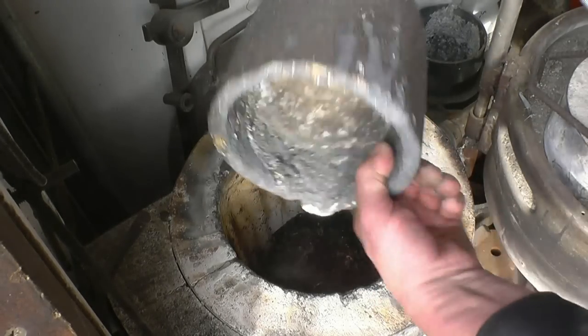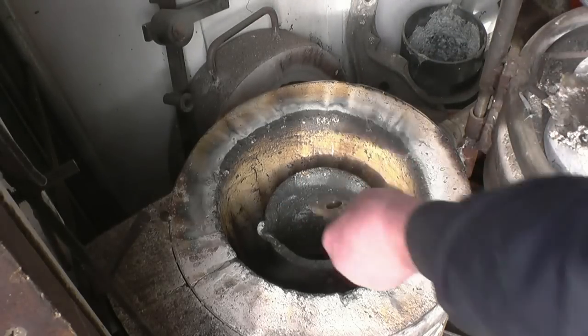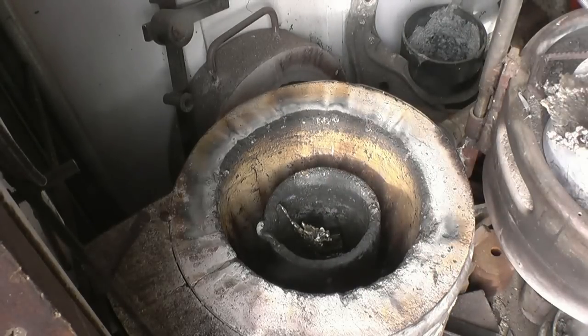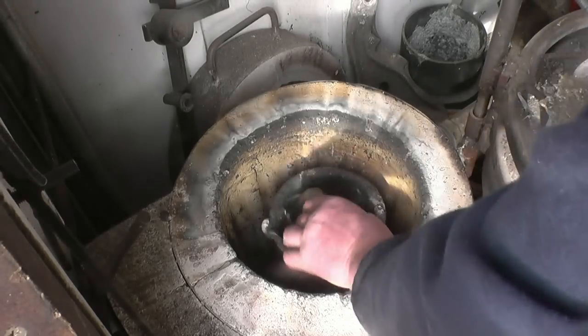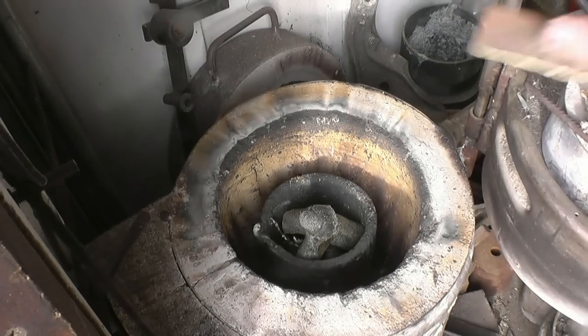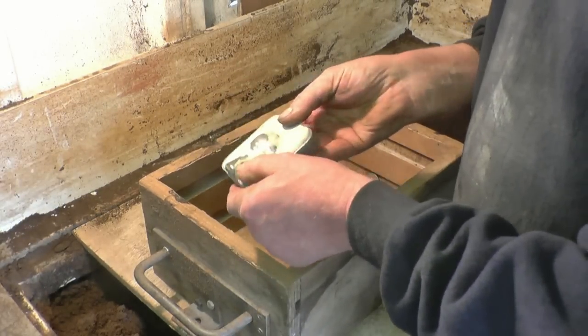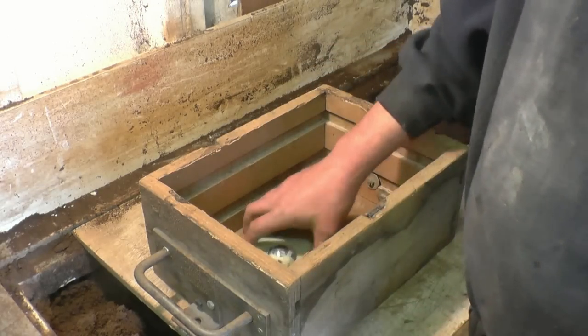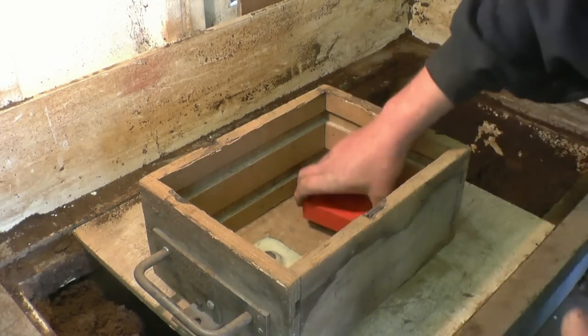That's the crucible I use — I just use it for bronze. This is what I'm going to cast it out of: some bits of bronze off a machine tool and scraps of bronze off the last casting. Once that melts we'll get some more in. Excess bronze is cast into ingots. Now I've got the pattern nicely cleaned up, nice and smooth — at least smooth enough for what it's got to do. I'm actually going to do two castings — I'm going to cast one of these valve chests as well for my friend Bob. So we'll do two in one go.